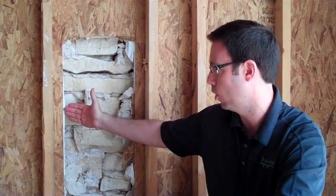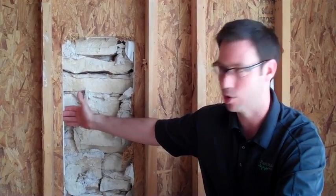Tyvek is a good way to stop it, but Tyvek is still vapor porous. A regular Tyvek home wrap is around 50 to 60 perms, so it is permeable. Commercial grade Tyvek, which I prefer to use, is closer to 10 perms — there's still a little bit of permeability. But really what we're trying to do is stop all that vapor drive at the front side of our sheathing or at the Tyvek layer. When using reservoir claddings, we really need to pay attention to our waterproofing, base flashings, and making sure we're taking care of not only bulk water but also vapor drive.